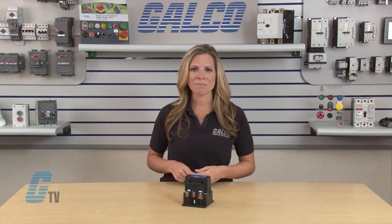These permanent magnet blowouts are mounted to surround the power contact and function to quickly quench the arc when breaking loads, ensuring a positive load circuit interruption.